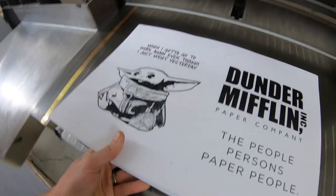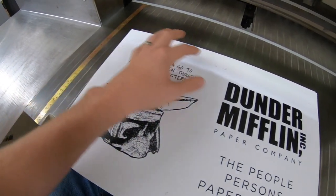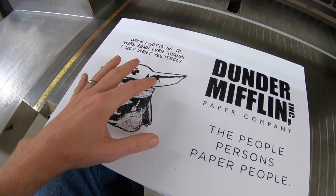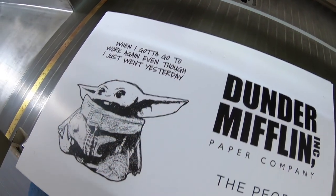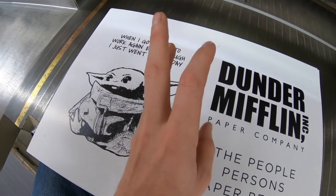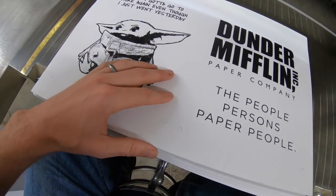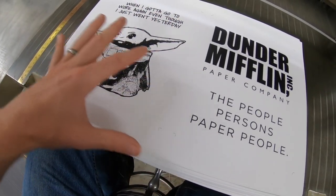I had several people asking me for more detailed explanations as far as crop marks and how we hit them on the cutter and layout as we're imposing things. I didn't impose this — it came to me as is. But there is a one-inch gutter here and there's no bleed. Theoretically these two could be right up against each other, so I'd only need one cut. But I typically stay away from that at all costs. It doesn't matter if there's no bleed — I still like to cut out a gutter. I just feel like my cuts are a little more accurate.